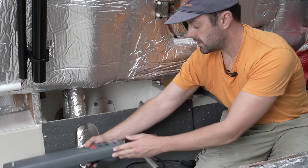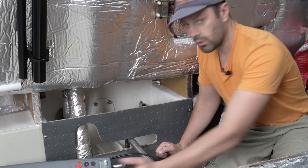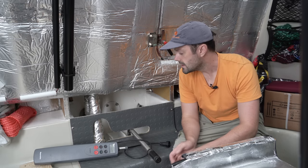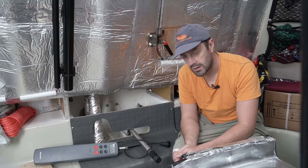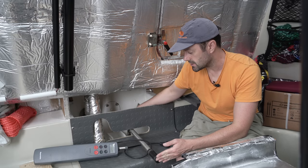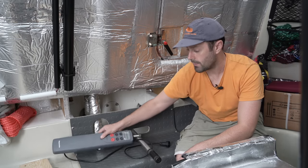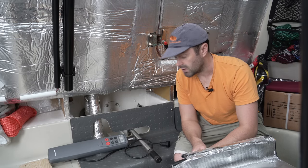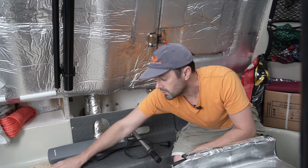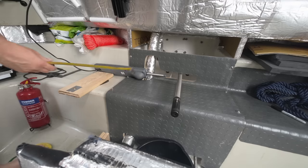The second point is that if you put it too far up this way, then the motor inside is going to be working extra hard, because it's not able to use the moment it would have with a longer tiller distance — because it's much easier to use the tiller out here than it is up close. Basic physics; I do remember some of my A-level physics. So what I'm going to do is a temporary installation. Because of those two distances — in particular, this distance has to be exactly 18 inches — I'm not able to mount it there, which is a pain, because that would be really neat. Instead, I need to mount it here, stepping off the bench. I'd like to do that using nice proper steel fixings, but I don't have the ability to do complex steel work here in the marina, so I'm just going to do it using a temporary wooden one, using the same holes I will use for the steel later on. Then I can just replace it — it's solid wood and I suspect it will do a perfectly good job in the meantime.